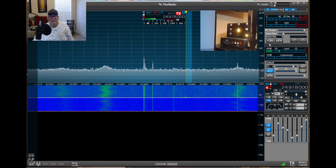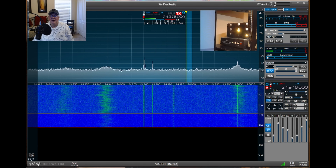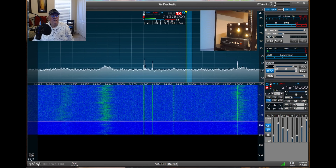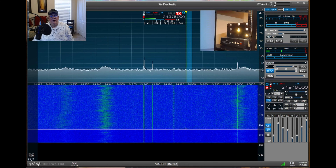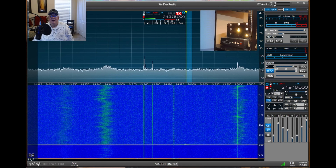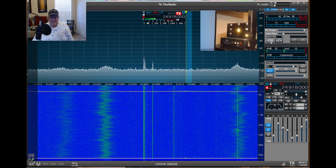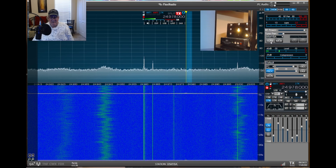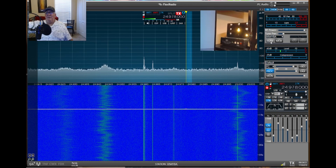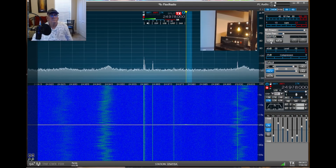Now I'm going to demonstrate the fine tune. There are two ways of doing it. When you're at your shack, you can press the tune button on the MFJ box, or the way I've got it rigged with a wire coming out so I can do it remotely or from the desktop. You hit tune, press the button, it tunes, and that's the fine tune. If it doesn't come in low enough, you press the button and hold it for about four seconds — same tune button — does the same thing. And it's tuned.